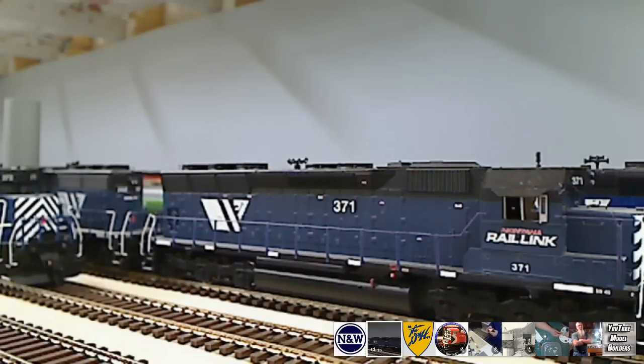So I'm going to jump it up to a 40. Or what did I hit? 49. Enter. So now it just wrote it to the decoder. Now I test, and not only does it run, but it's running way too fast at speed step 1. So I could bring it down a little. Same thing again. CV2, enter. What do I want for value? Let's try 37. Enter. And now I test it, and that's pretty good.